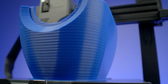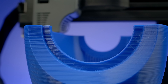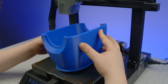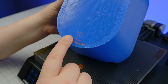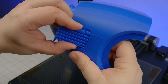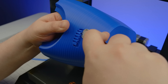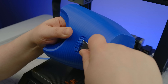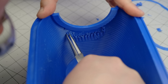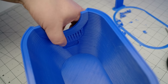It looks almost as though the lead screws were somehow lopsided, with each stripe representing one full rotation — an oscillating layer shift, if you will. Which is kind of a shame, because in every other way the print does appear to be alright. Getting it off the build plate was no trouble at all, and the underside has that nice glossy texture, complete with logo. Here's where the print lifted, here's the brim coming off, and here's the first sign of trouble with the stripes. When printed correctly, these supports are meant to peel away without effort. However, shifting layers also means shifting clearance, inadvertently fusing the supports to the model. I managed to pry one loose, but the internal ones simply wouldn't budge — so after some time, I elected just to leave the other one fused.